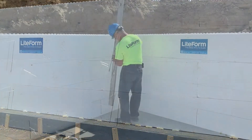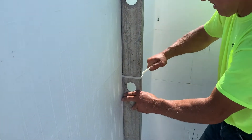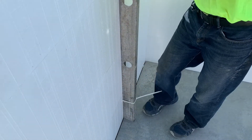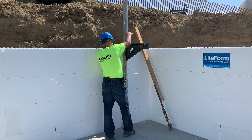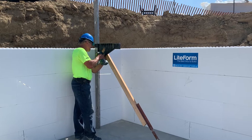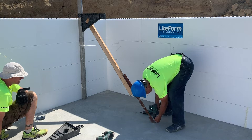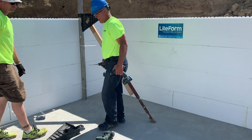Once the wall is assembled to 4 feet, the outside vertical form braces should be firmly zip-tied to the form. In this project, Lightform steel studs are being used. Braces must extend the full height of the assembled wall to maintain proper alignment and protect the forms from wind damage. A Lightform scaffold bracket is being installed to receive the diagonal brace. An adjustable 2x4 diagonal brace is attached to each vertical brace using a 3-inch drywall screw. Diagonal braces must be anchored at the bottom of the form. An adjustable turnbuckle has been attached — commercial turnbuckles allow for precise adjustments and can be purchased or rented.